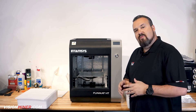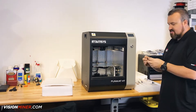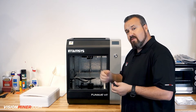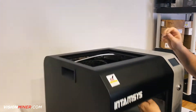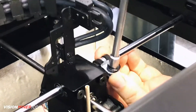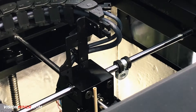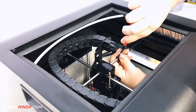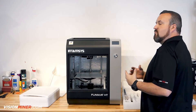We're going to move into prepping the extruder and getting the machine ready for its first print. Those clamps on the X and Y-axis hold the extruder in place to keep it from moving during shipment. We got the 7mm nut driver and the 3mm Allen screw. I already took three of them off — I left one to show you exactly how to do it. We're going to go in there, hold the bottom with my finger, and start undoing this. That nut came right off. Take the washer off, let the screw fall out. I'll keep these in the package in case I ever have to send this in for service. Then I take the needle nose and spread that apart to get it off the bar — all four clamps off.